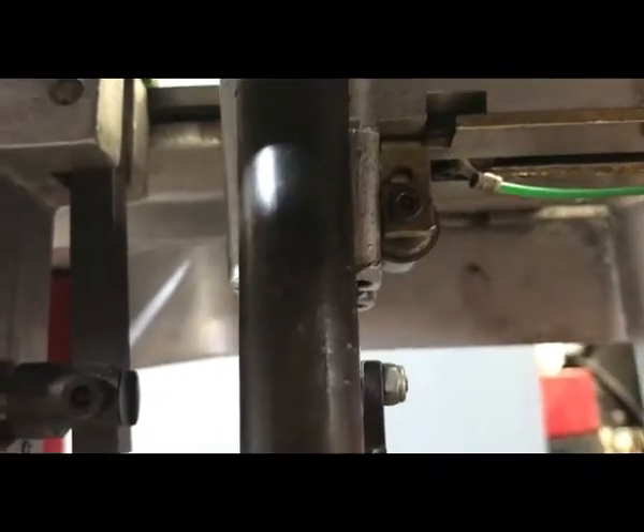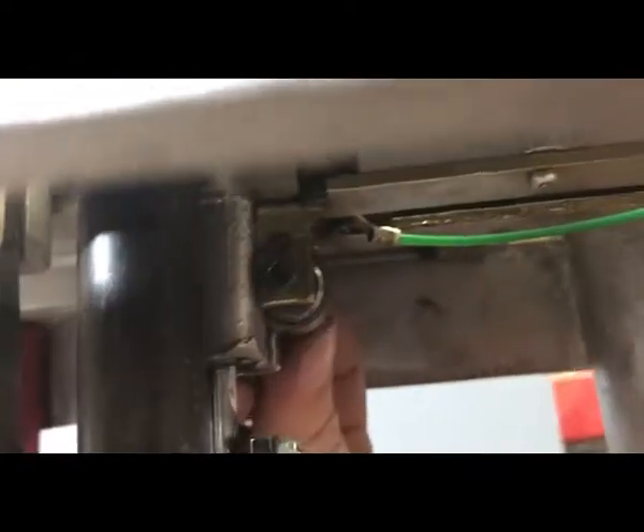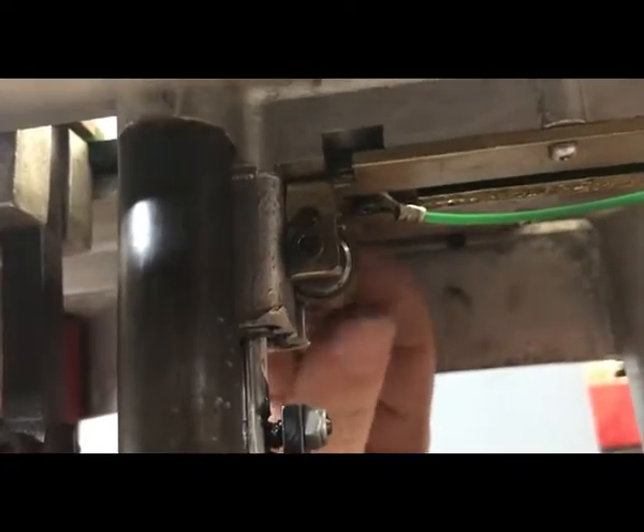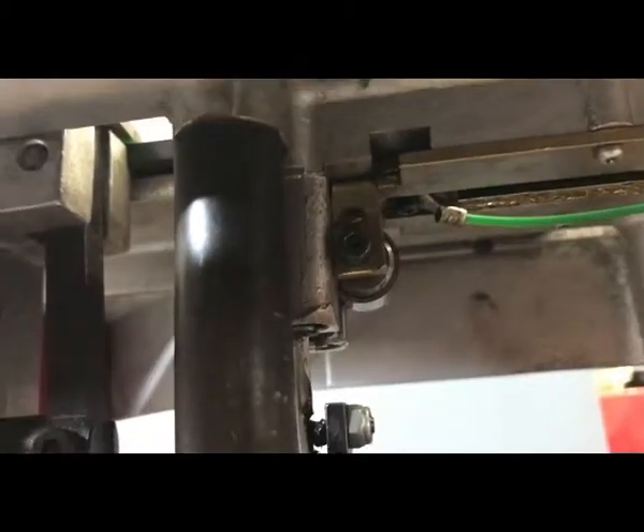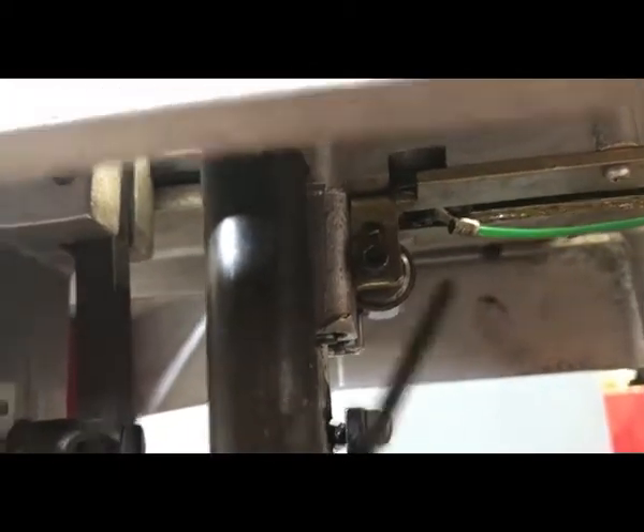You can see we've pushed the screw through the axle, and now we can tighten it up using the 7mm spanner and the Allen key on the other side for the nut.